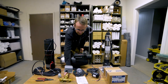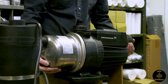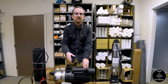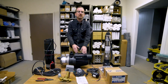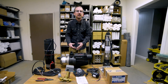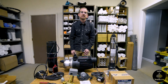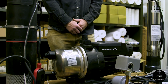The other method for protecting a jet pump is to upgrade to a type of pump that has built-in run-dry protection. This particular model has a built-in pressure tank — you don't need a supplemental pressure tank — and it also has built-in run-dry protection. It measures the amperage being pulled by the pump motor, and if there's air in the line the amperage drops, it detects that, and shuts the pump off automatically. This is a great way to have peace of mind with a new, more modern pump style.